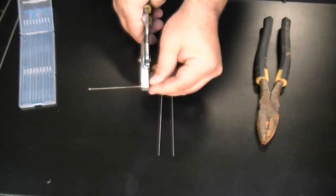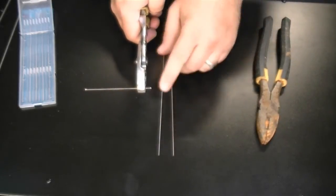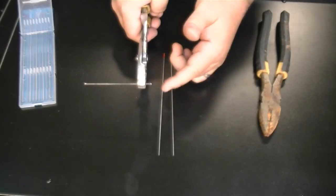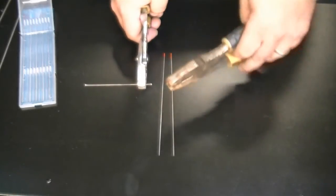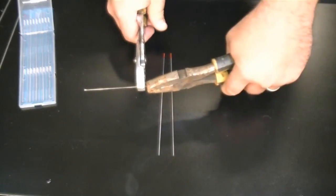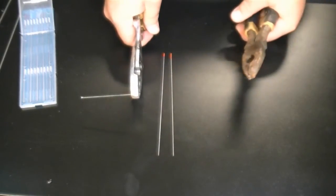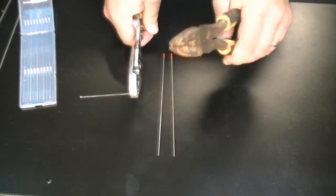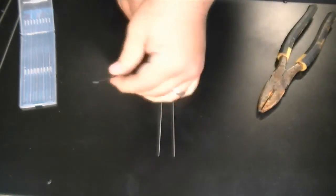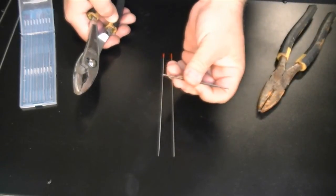You may want to choke up on it just a little bit. The best idea is to snap off the affected part — the part that's contaminated. Take another pair of pliers and run it up pretty close to the other pair and just twist with a little snapping motion like that, and we've broken off the piece of contamination. Then you can take this piece and go sharpen it.